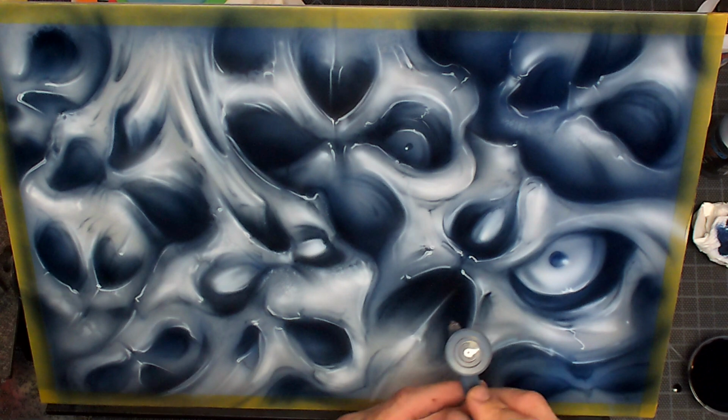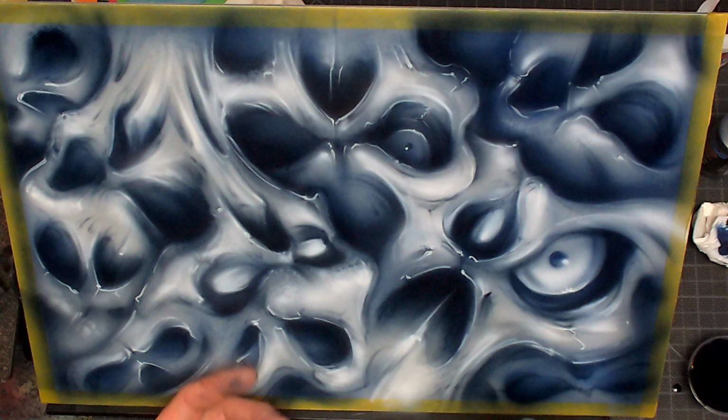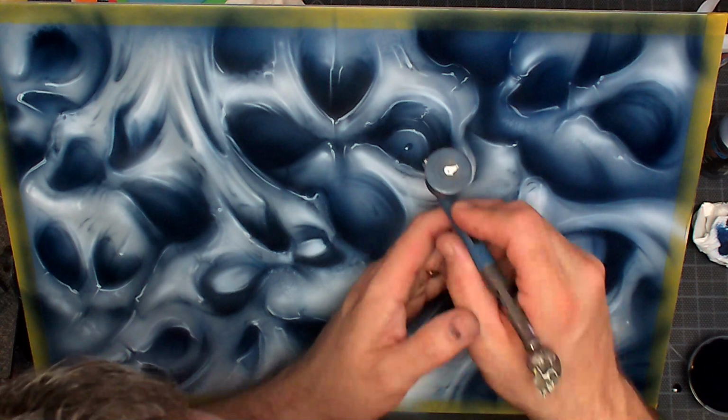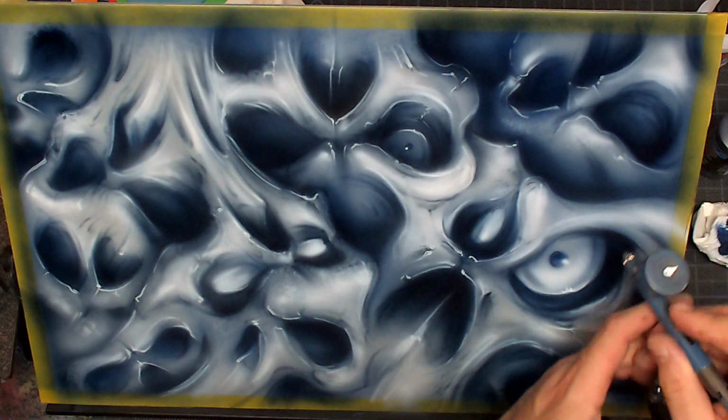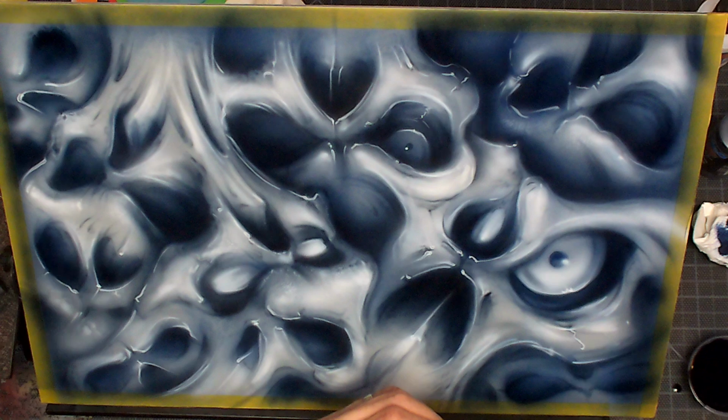With the new 40-50, you don't really need to use that bleed check sealer anymore to be able to do white on top. I mean, you can if you find it's a problem, but the 40-50 holds the dye into the resin so well that you don't really need it. Because before, the dye load, the aniline dye is so heavy, the white would hit and the white would turn whatever color.